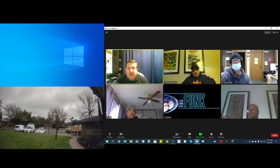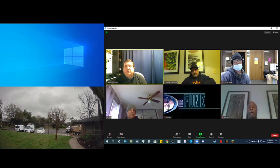So you can imagine all the work that they were putting into this floor. They changed over to using a system of that DOI pad, which is that definition of image. It's basically a super high grit, usually about a 5,000 grit diamond that they're maintaining the floor with nightly. And it's constantly polishing every night. So now all they do is sweep it, and then they run the scrubber over. There's no buffing of the floor. It saved about 30% of their labor cost by doing that. And their material cost, because they were no longer applying a coating, went down significantly. So just some important things.